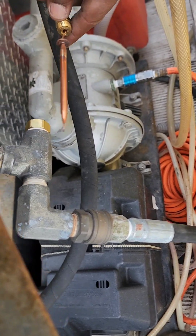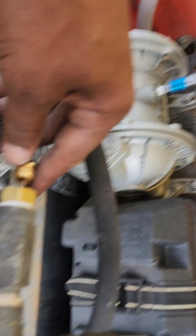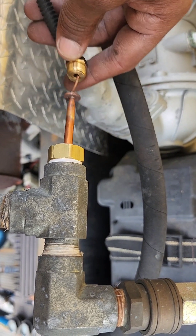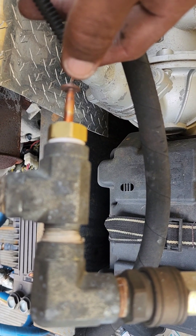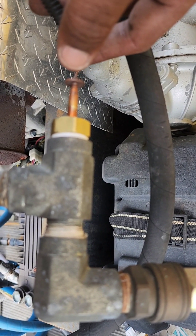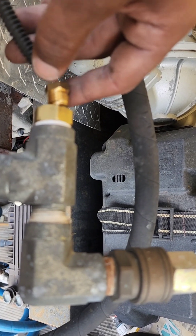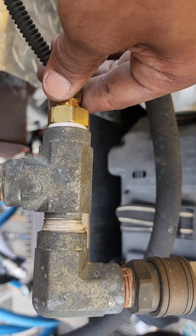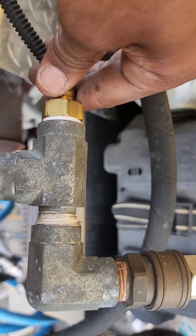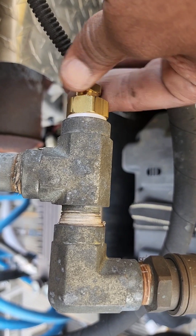From there you want to go ahead and slide your thermostat in. On this nut here, slide the thermostat in. My issue was this entire top cap came apart from the well — wasn't getting a connection. So slide that in there, and this nut you don't have to put Teflon on it — it's going to fasten itself. If you put Teflon on it, it's going to leak.